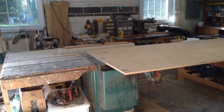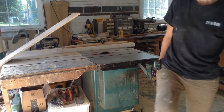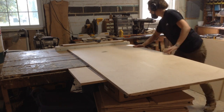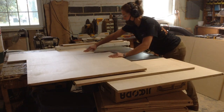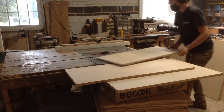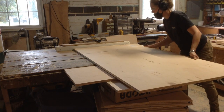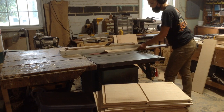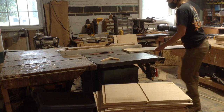Then I'm going to cut my shelves — I'm just ripping off a little piece of material and then cross-cutting them on the table saw. My cross-cut sled isn't wide enough for this, so this is not the safest cut when you have a large amount of material cantilevered off the side, but as long as you do it slowly and apply pressure in the right spots it becomes much safer. I usually make this cut on the radial arm saw but I designed this to use the least amount of plywood possible, so cutting lengthways like that would have been too long for the radial arm saw. With the leftover pieces I'm making those four-inch slats that go on the top of the cabinet — I don't use full sheets of plywood there as it just makes the top unnecessarily heavy.